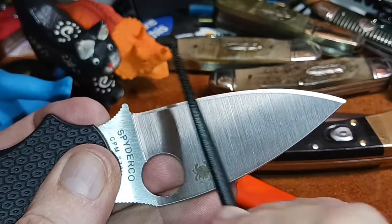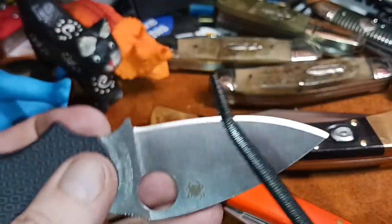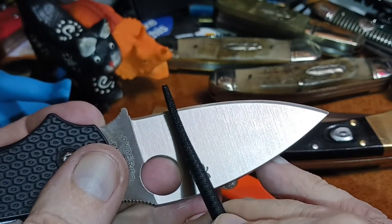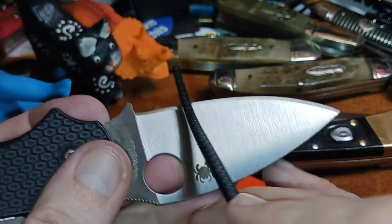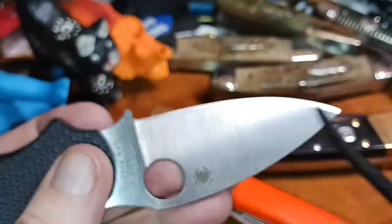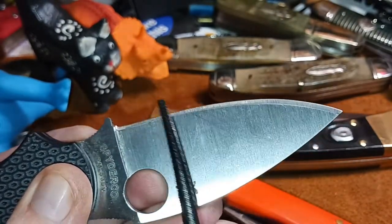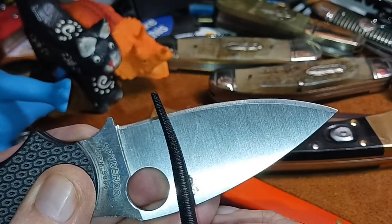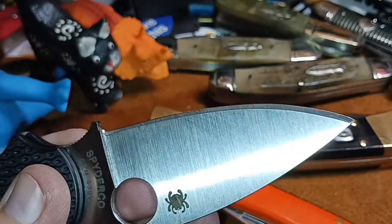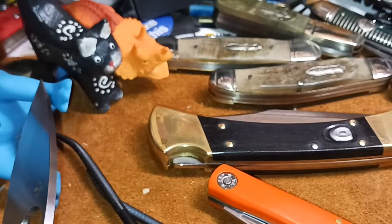Again, it slides, but it's biting a little bit. This is going to be a way most of your steel is going to test, I guess, between 60 and 65. Man, it only barely scratched that at 65. You can hear it digging in. Yeah, so this is pretty tough.